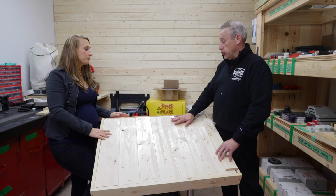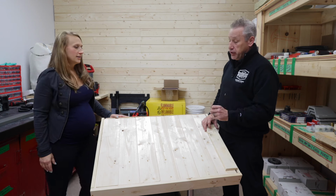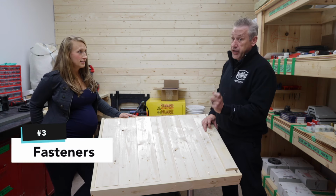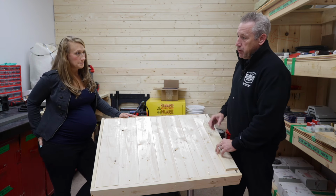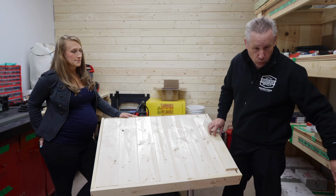Yeah, so roofing nail, you mean for the actual underlayment or for the steel itself? For the steel itself, our fasteners. We do sell a 1-inch fastener. Our 1-inch fastener, though, is really meant for siding, and I'll get more into that when the time comes. Because what we always want to try and do is make sure that when we put our fasteners in, we're going through the actual rib of the steel.